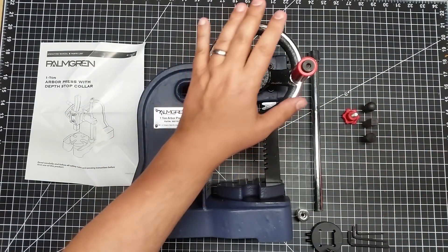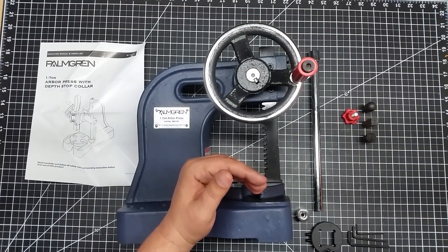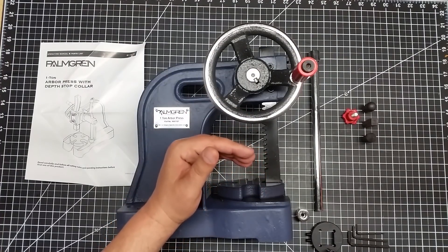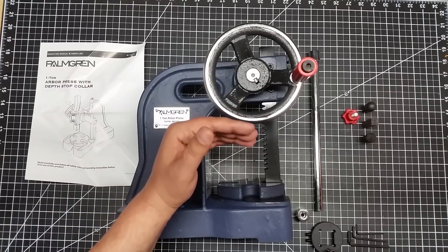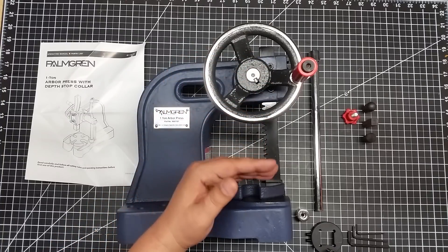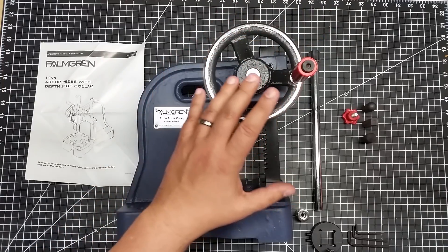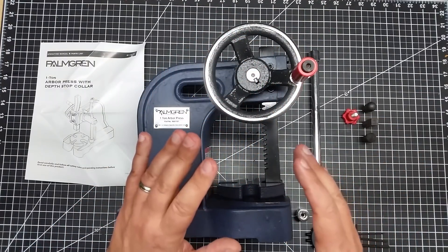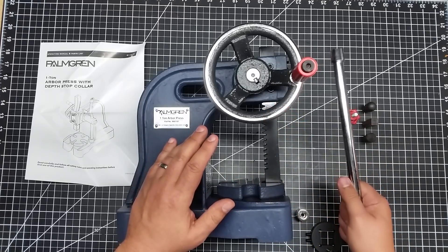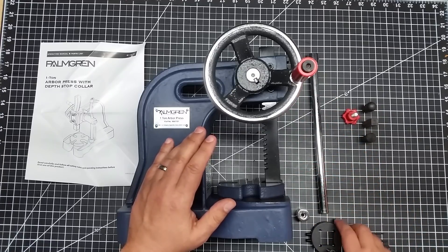One of the pieces I liked about this is the wheel, which screws in here and allows you to spin it down quickly. You might ask: why do I want this when I've got the handle on the other side? What I liked is this allows you to quickly run down the arbor and get it centered before you put the pressure. The idea behind this press isn't to get velocity like a pneumatic press — it's to come down and put uniform pressure through the gearing and lever. So you want to run this down onto your part and then press it, and the wheel is a real quick way to do that rather than ratcheting the handle back and forth.